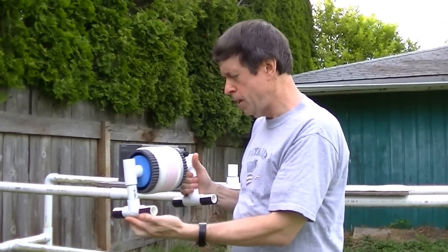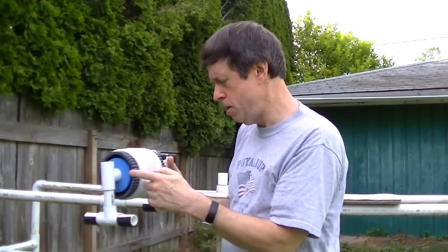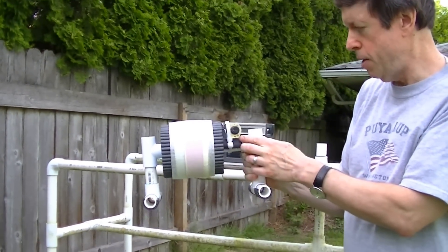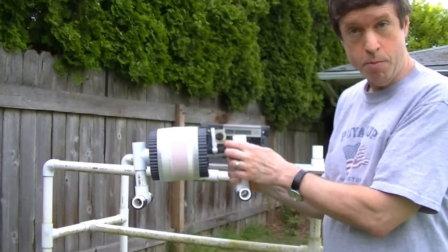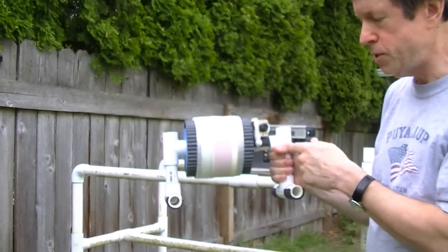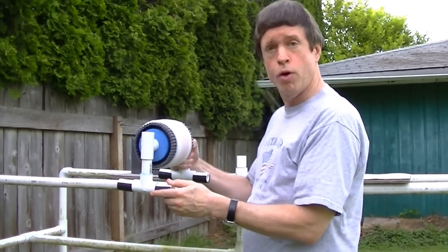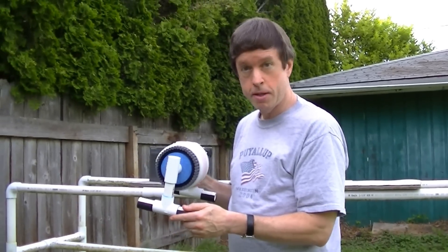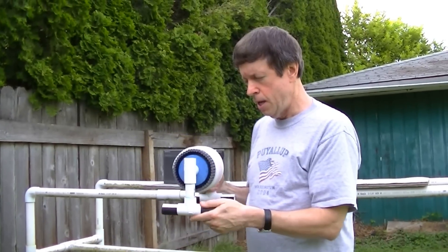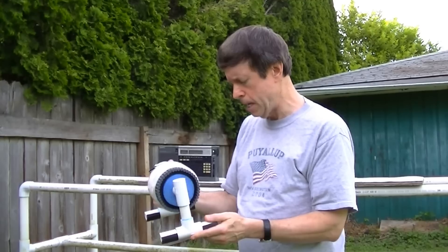As you can see, it's a fairly small model. It's composed of 45 of the 140 by 8-millimeter ferrite rods, and it contains a variable tuning capacitor — a 381 picofarad model — and it also has a 660/46 Litz wire, 26 total turns. I did write a full construction article with Heathkit-like assembly instructions on this particular FSL antenna, and I'll be happy to post the link for those who would like to make one of these high-performing antennas.